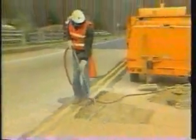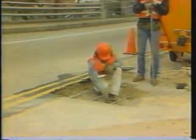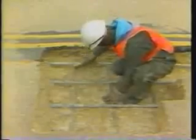Use compressed air to remove loose material under the exposed steel bars. If the damage extends down to the reinforcing steel or below it, make sure a space of at least two centimeters — slightly more than the width of a finger — exists around the reinforcing steel so that a good bond will be made between the new concrete and the steel. Then, clean the exposed reinforcing steel bars and the concrete surface inside the hole. Use a wire brush to scrape away any rust. The steel must be clean for a good bond with the patching mixture.